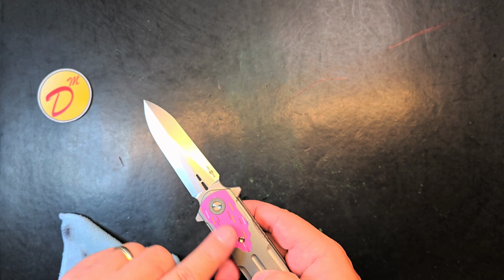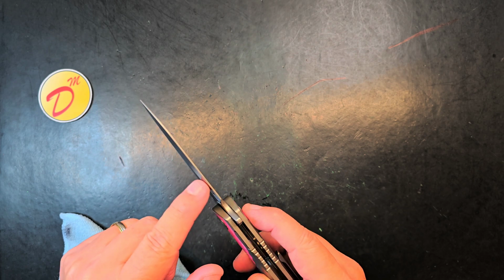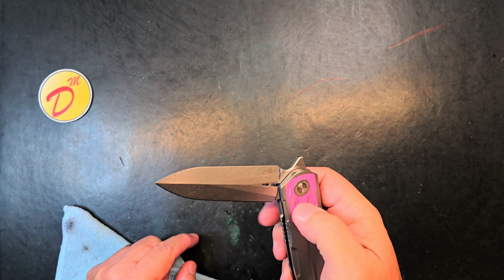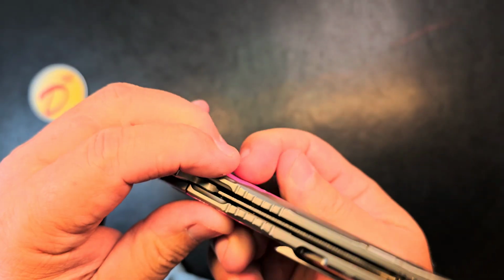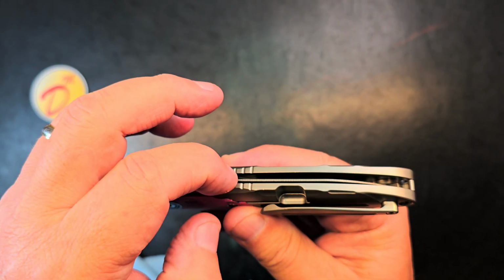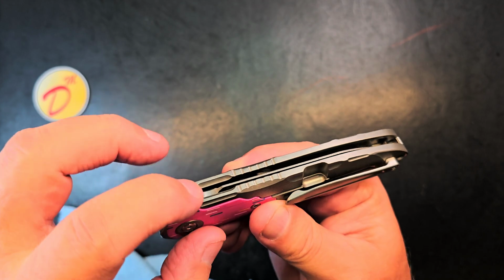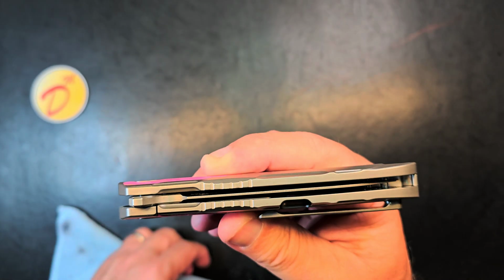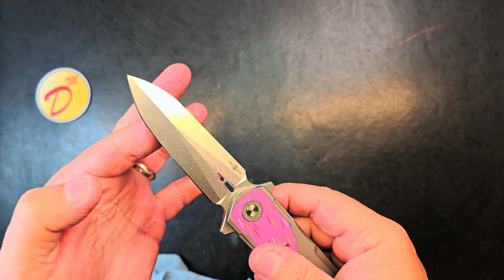So I wanna manage these sprinkle scales. I want to do something with those, but then I think I'm gonna put a double edge on this knife. And when I look at this knife, I can get all the way to here, right here. Like I can contact that piece of the blade right there, but from there forward, I can't contact that blade. So I think I'm going to grind a second edge up here on the top of this knife.